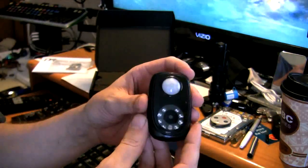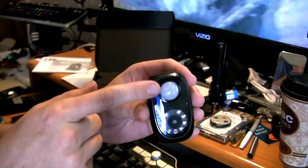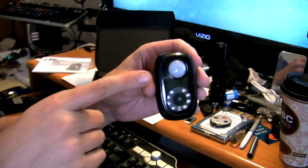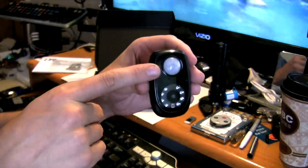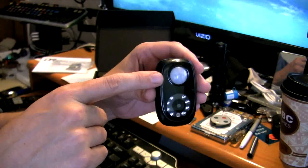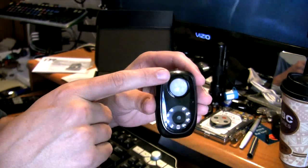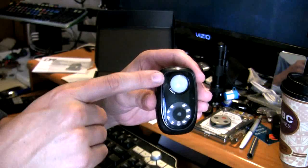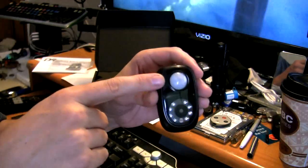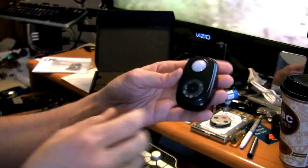What makes this one special is it has what's called a PIR - passive infrared. Normally they have two sensors on the inside: one measures the ambient temperature in the room, and the second sensor - I think it's called a black body sensor - detects body heat. It compares those two, so when the sensor is reading the room and not showing any temperature variations, the unit will be in standby mode. Then when someone walks past it or it senses a heat source, it activates the recording function.